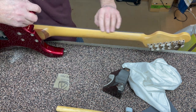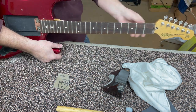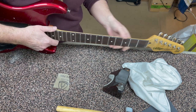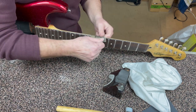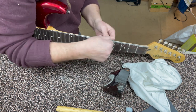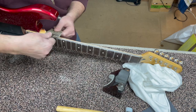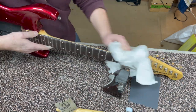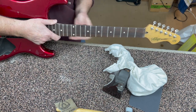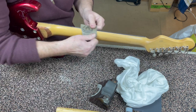Now this is now beautifully smooth, and now that horrible little edge is gone. But it's taken a bit of the colour, because they make these look vintage by, guess what, painting them with amber finish. So that's how they make them look aged. And so as soon as you have a repair like this to do, you will lose the colour because it's very thin. But like I say, we've got some amber stain at home, which we can add back onto this.